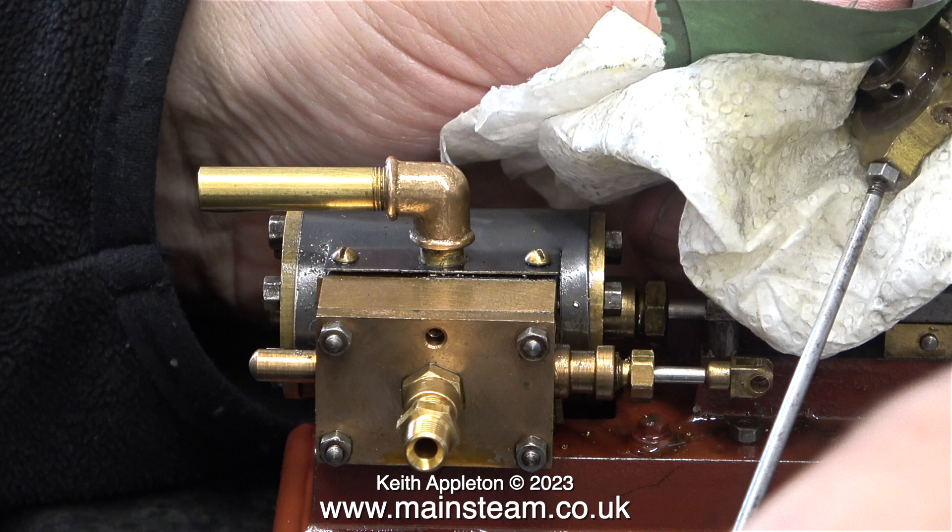You may be wondering why there aren't any studs in the two centre holes — I know you can't see the lower one, but believe me there's a hole there too. That is because, if you think about it, if you were to use a stud, it would go straight through into the exhaust port at the top. The two middle studs are dummies; they only go through the steam chest cover and hold the steam chest cover to the steam chest, not all the way through to the cylinder.